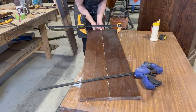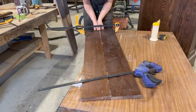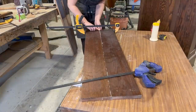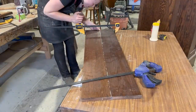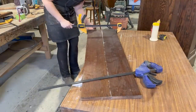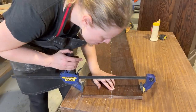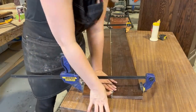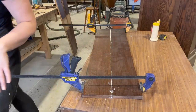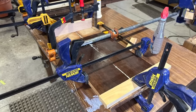And this is where we'll find out if we need to refinish or not, if I can get the joint flush, because this one's a little bit wonky on the back. So I'm just gonna work really hard at getting that glue up nice and flush. This one's good. And then it shifted. I'll put a couple cauls on it. Anyways, we'll get that all put together and then the other one, and get to working on the cabinet.